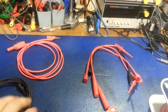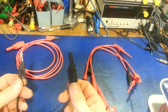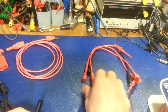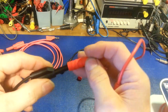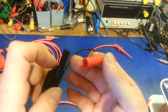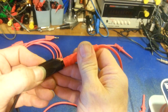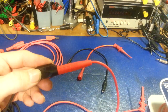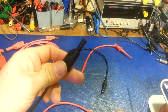Now you're probably looking at this going — well, now I've got pieces of wire with a banana plug on each end, but how do I attach it to everything? That's where you can buy the test lead ends. When you buy a set of Fluke meter leads they come with an assortment of ends that have the double-insulated design — so you've got a plastic sleeve here, plastic sleeve there, and plastic sleeve on the outside. Once you plug this in you've got three layers of plastic insulating you, so it's very safe. I work with tube-type equipment and high voltage on amplifiers — well up over a thousand volts — so safety is key for me.